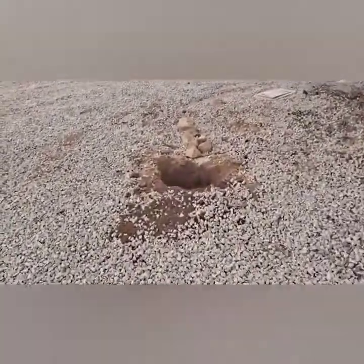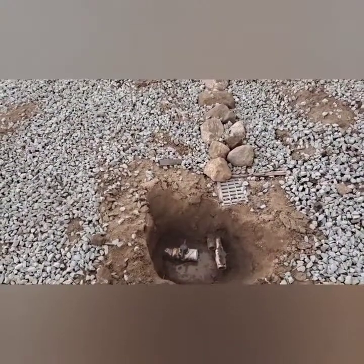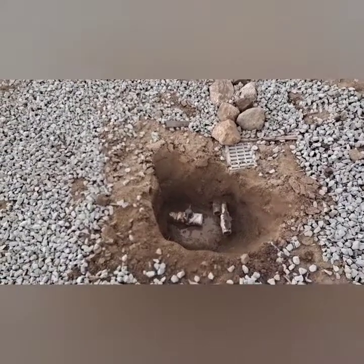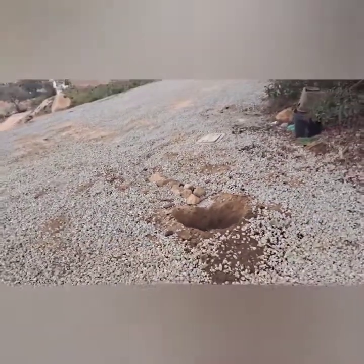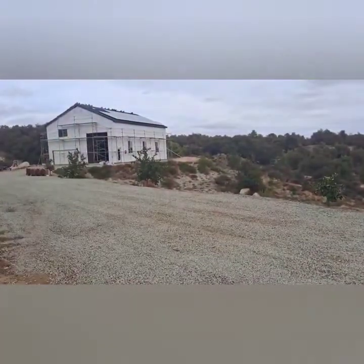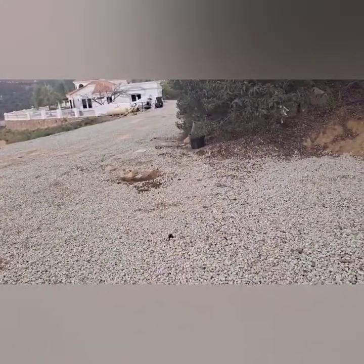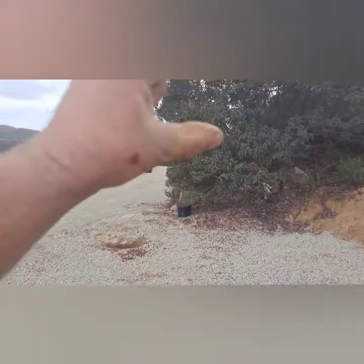All this is leveled with a laser level and I've got my water connection ready to go. It's really going to be fed by this inch-and-a-half line right off the main. Eventually I'd like to repurpose this fire tank as a partial well water storage tank. My minimum for that garage was 3,500 gallons, and it's a 5,000-gallon tank—so I could use 1,500 gallons for well water, which would mean making an attachment at the upper 1,500.